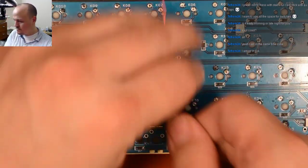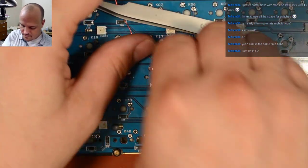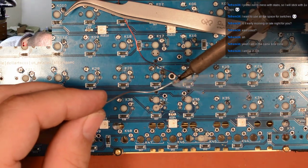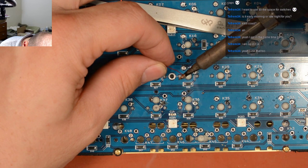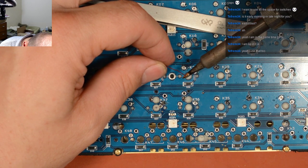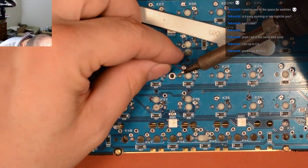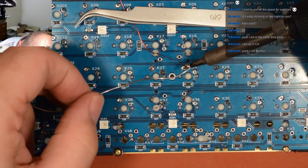So I'll just connect a jumper wire. So this is magnet wire, and it has an insulation on it that melts if you get it hot enough. Melts away. So what I'm gonna do is tin the tip of it, to get it really hot to burn off the insulation. Actually, I don't think my iron's turned up hot enough. If the iron's not hot enough, it won't melt. Okay. There. So that's tinned a bit.